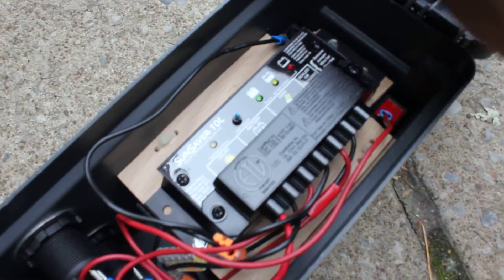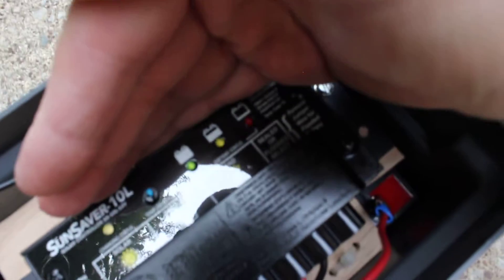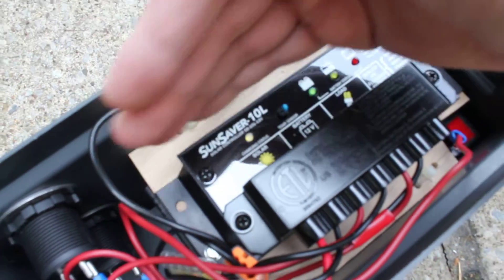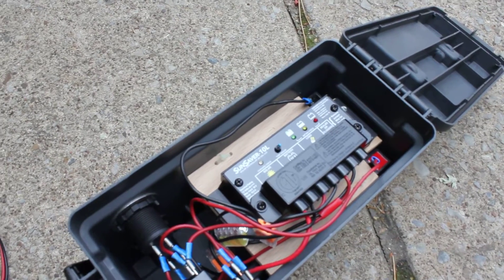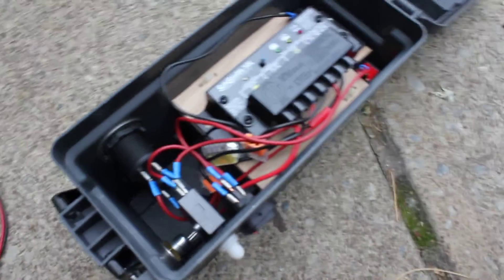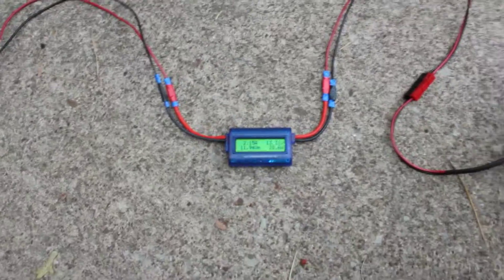Everything's got glossy finishes on it, so it makes it a little tough to see. But you can see the state of charge light is yellow, and then we're getting the green status light on the charge coming from solar. There are various states of the charging status — it'll blink depending on whether it's floating, bulk charge, all the different stages. Right now it's just pulling as much power as it can from the source, which is obviously the solar panel over there.